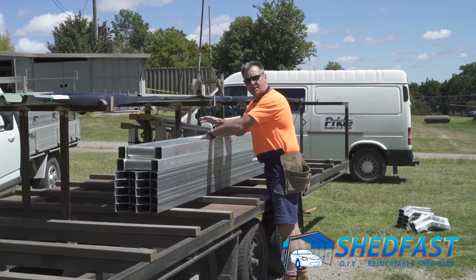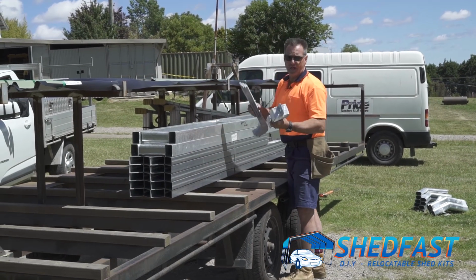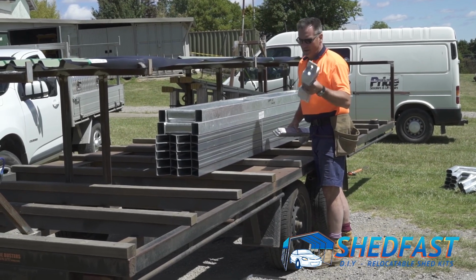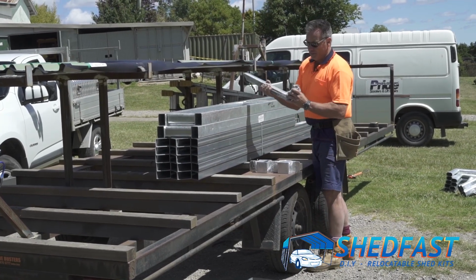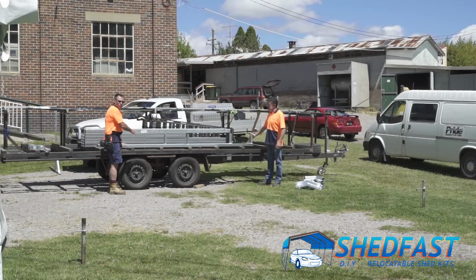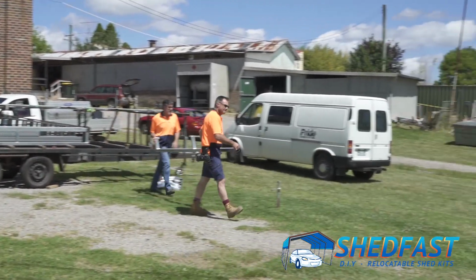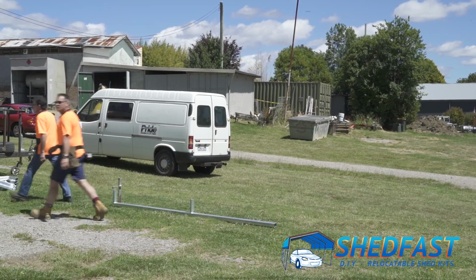So you'll find under the connectors that I pointed out before, this kit has come with pier anchor installation. So there's the saddles, which are universal. They will be a saddle to go into a slab, a pier, you can chem set them, whatever you need. The saddle's universal, but the L bars, they are for the pier, and I'll show you how they go together later, but they're in the kit as well. What we've got here are the two B rails, and they go to the back. So we'll just put one down on here, just like that. And then an A rail to the front.